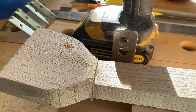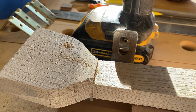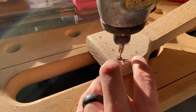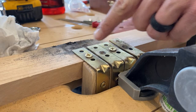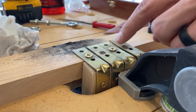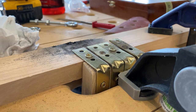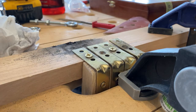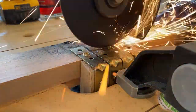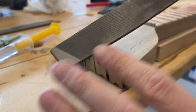These flies are all over me — I actually bought a little shotgun that shoots salt about a year ago. There's a video on my channel about it because it is amazing and I hate flies. Anyway, the problem I ran into is these holes were too high and too small for the little brackets. So I drilled new quarter-inch holes and I'm cutting the top of the bracket so it doesn't hang out so high on top, using a cutoff wheel — you can also use a hacksaw. Then I'm just taking a file to clean up the edges.